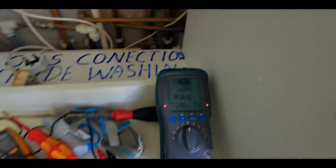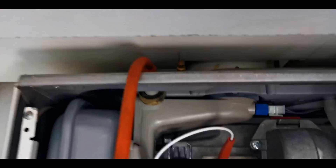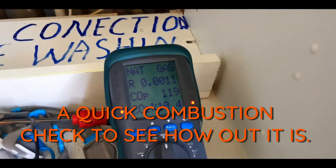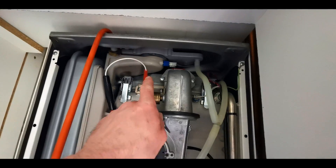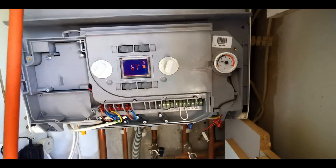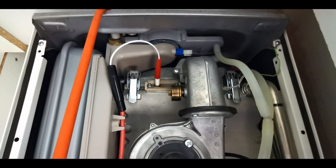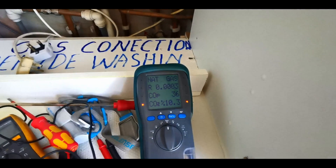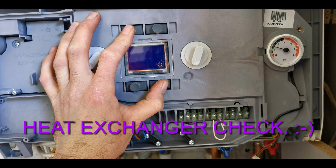That was a near miss — combustion sounded bad then. Let's run a hot tap — it will take a long time to react because I've got this additional tube on here. By the way, this is a new electrode, new lead, and new gas valve. Inlet pressure is correct. Diverter valve has moved over. It lit with a bit of a warm-up and is now running on basically low — 10.3 — seems a bit off to me. Like a negative fan pressure check on a Worcester, this Alpha has a check that checks how clean the main heat exchanger is, so I need to do that first before setting up combustion.